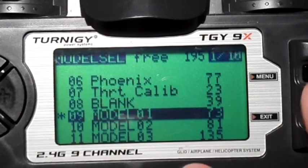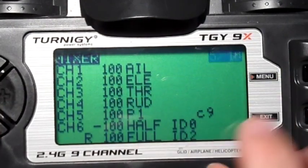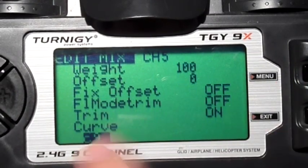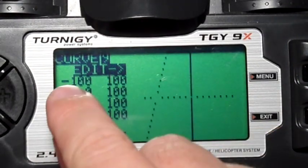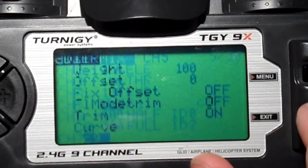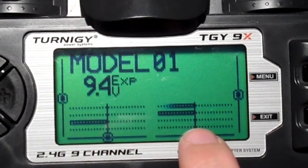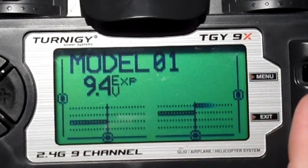So model one is the pot. To do a small amount of movement in the pot I've just used a curve, C9, and the curve is just a really straight line: minus 100, zero, 100, and then all the rest left to be 100. I'm actually only turning the pot a really small amount here and that's changing the value — like a big change for just a small amount of turn on the pot.